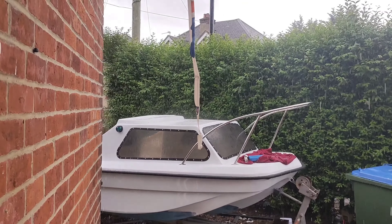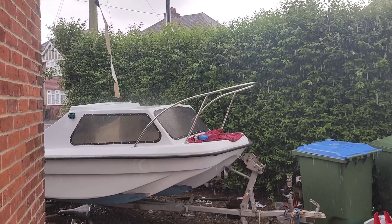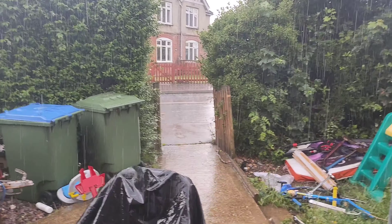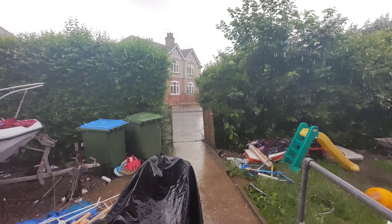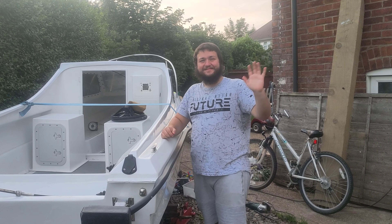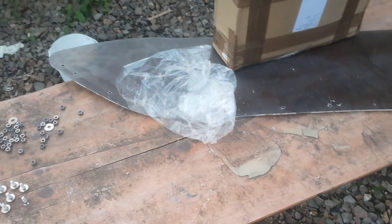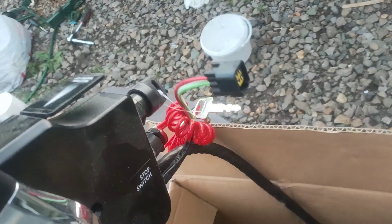Plenty of length on the rub rail — there's a bit more length there and some left over. We're out here today sorting out some of the boat. I've fitted the other witch's hat. And I've just put a big hole in the boat — this is where the bilge pump outlet is going to come. I've also run into a problem with the steering — apparently it's three inches short, so I've got another steering cable that I'm going to put on and donate this one back.